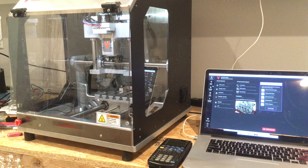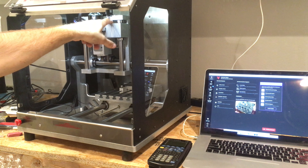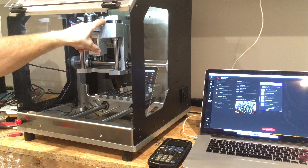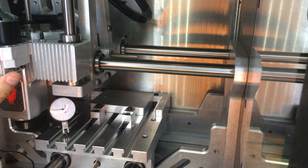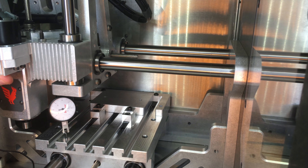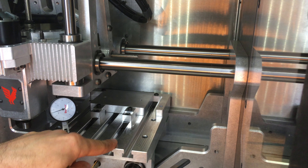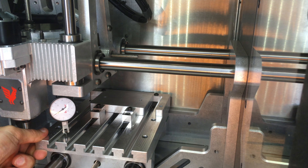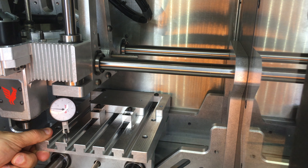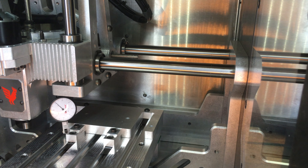Back to our slow-ass homing. It's a neat feature that they have manual belt tensioning with just a threaded screw and a nut. Every number you see on the dial indicator is a thou of play. This machine is energized right now and I can very easily put five thou of force by hand — and the same going the other way. Even on X with these really rigid shafts, putting about 20 pounds of force gives four thou of motion.